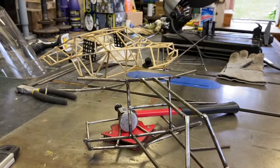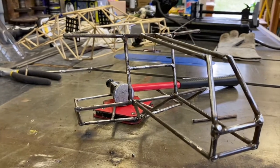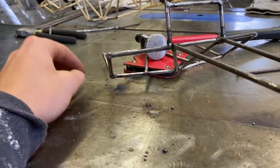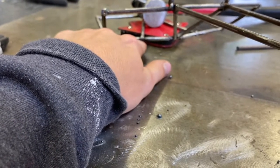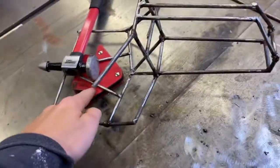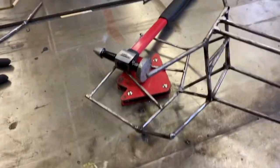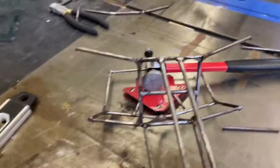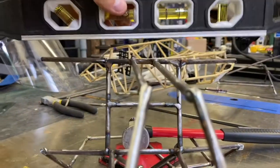I just tacked in those two pieces and here's a cool little trick. Make sure it's level. The problem is I can't put the frame flat on the table because I have these little spot welds sticking up, which I'll grind down. But I know these two are level, and the magnet would be level because there are no rivets underneath — only these spot welds stick up. So I lay the magnet down there flat, with the hammer for extra support, and place the level right on top.